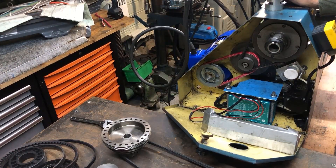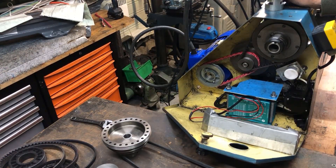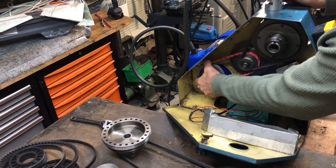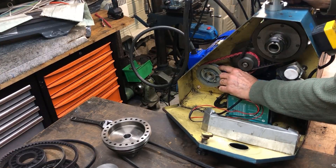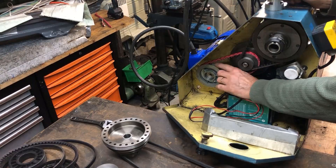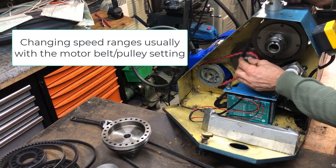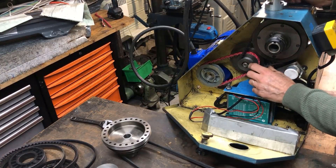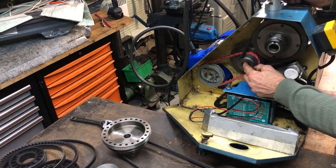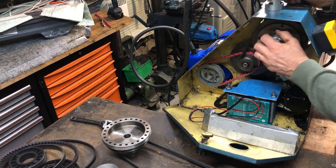I've tried different other systems, as I will tell you also, but as for now at least, this here produces the best results. I've opted to use just a three-pulley system down here, actually from a Myford, running up to the intermediate pulley which I have securely mounted, and then I can use the smallest to the largest ratio here to the spindle.